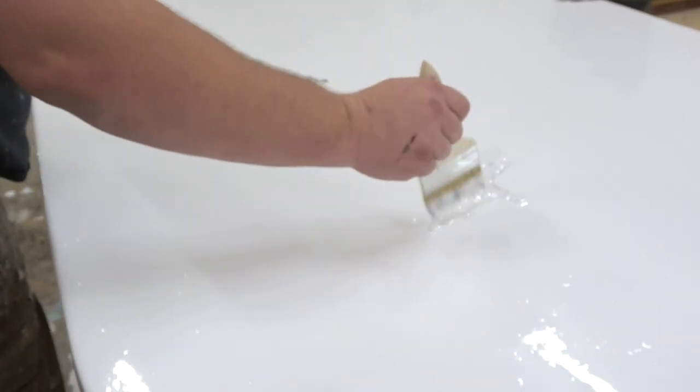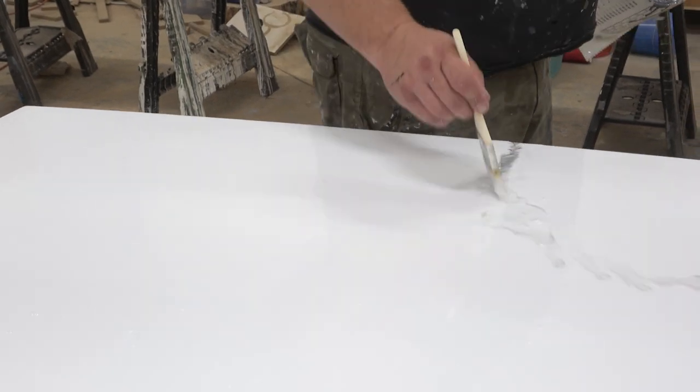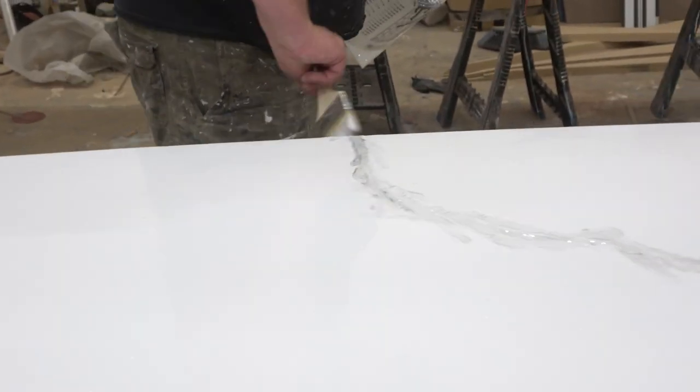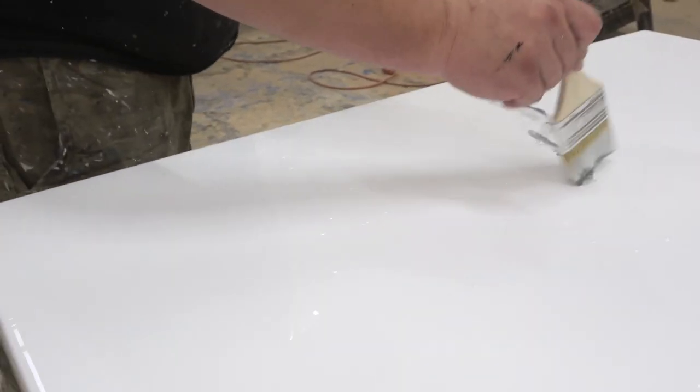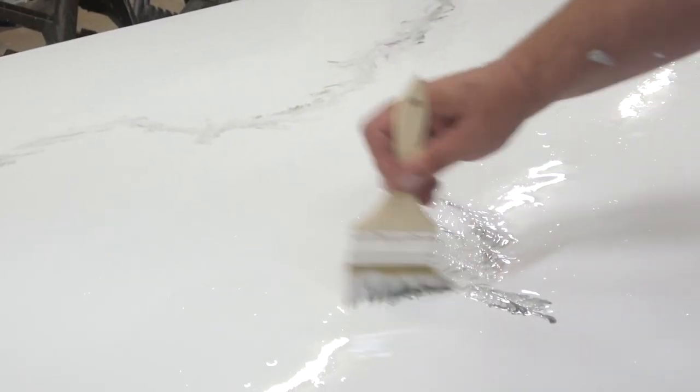With this we're doing the marble gray. As you can see, I'm just using a chip brush — I'm going to roll my wrist as I put it into the epoxy. The key here is not to jump across it like bunny tracks; I'm actually keeping contact with the epoxy as I go and rolling my wrist to get that nice marble look. If you had a little blemish you want to cover up, a really good tip is to take some paint and go over the top of it — it'll hide it and you'll be able to proceed with your project.